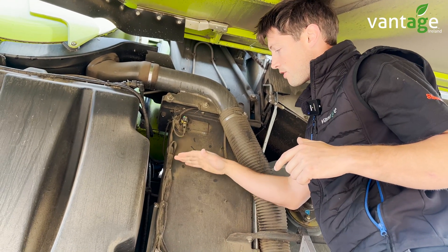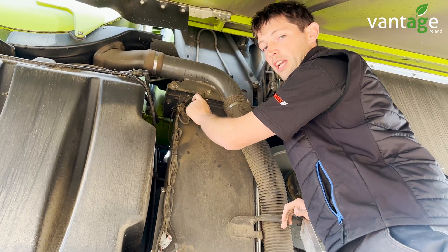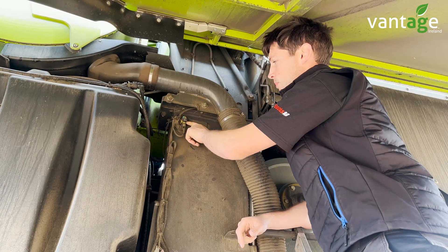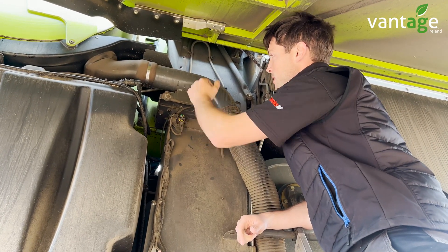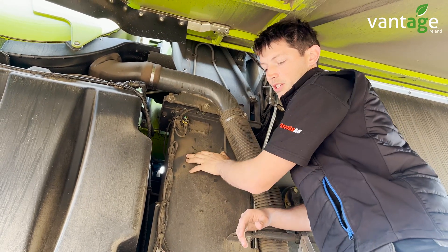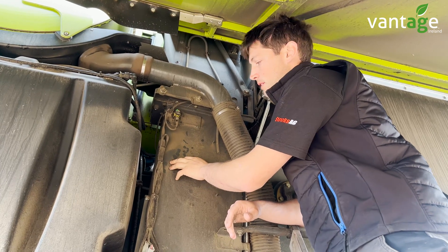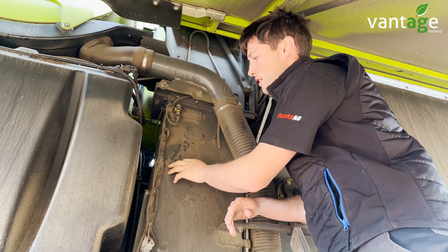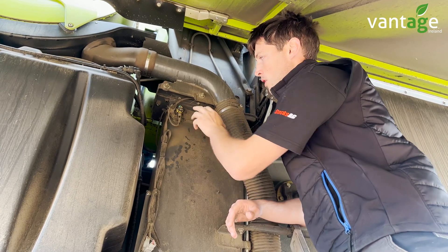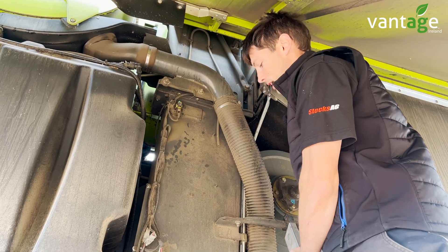We try to keep the sensors in the centre of the paddles, and as the grain is coming up the clean grain elevator we're reading it there. It's important to have the sensors up as high as we can — we don't want any grain falling down the paddles; we want the best reading possible. It's also important that the paddles are in good condition and the clean grain elevator chain is kept tensioned and in good condition, as that could affect your reading. When we fit them, we calibrate the system after fitting and go from there.